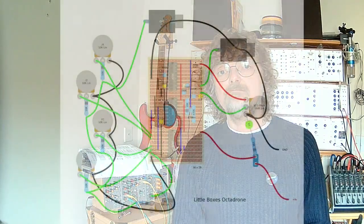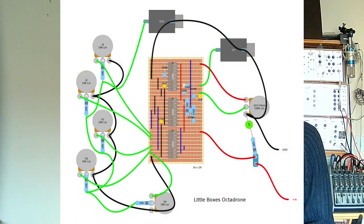What does it look like when you put it on a stripboard? The stripboard layout I decided to use looks like this. As you can see, it's basically three chips and very few other components, and a load of jumper wires connecting things to the right place. The passive mixer basically sits on the pots themselves — just pots with a resistor attached. Nothing particularly complicated, a lot of wiring because of the mixer section, but really straightforward. I'll put the circuit diagram, the stripboard layout, and any photographs in the Dropbox folder — the link will be down in the description.